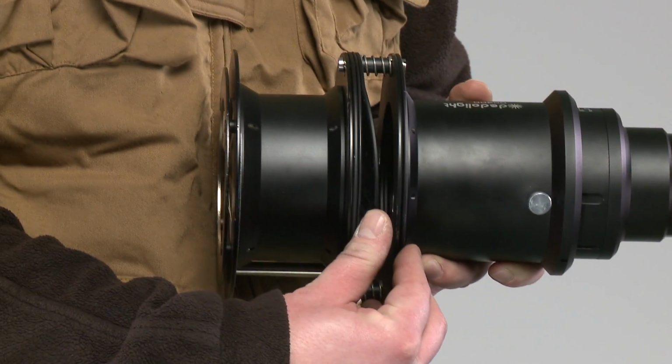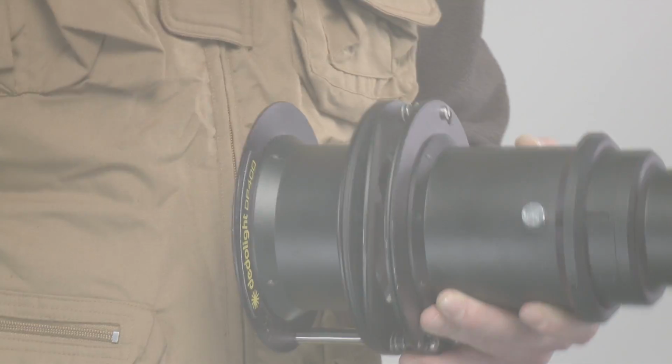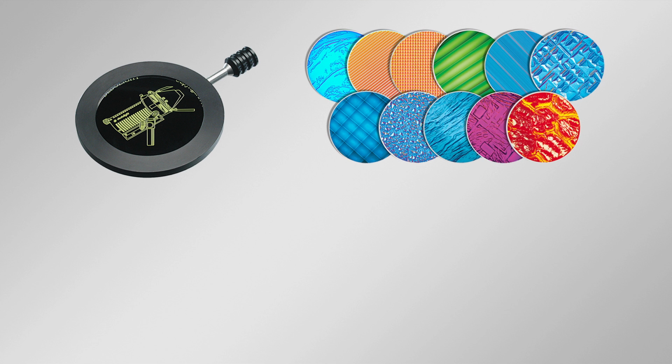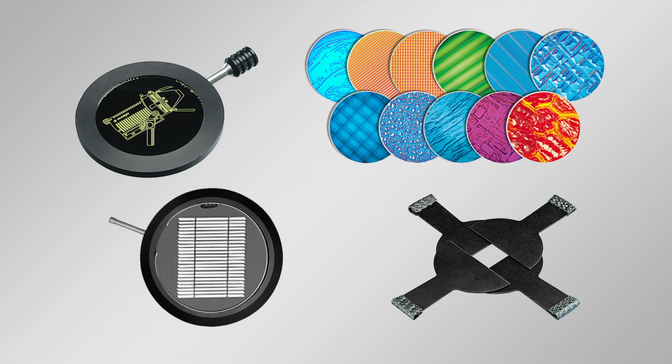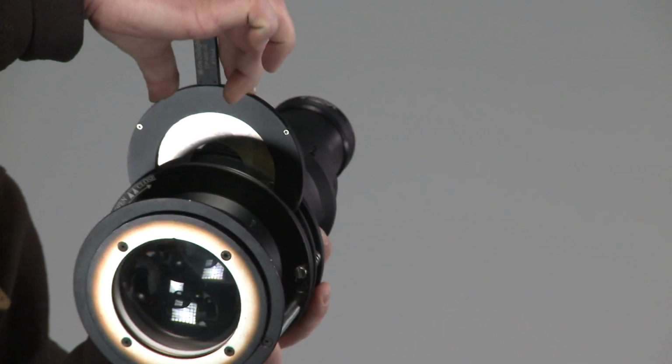Another one is the universal module. This is a receptacle that will accept the following optional accessories: a glass gobo holder, a holder for special background effect glasses, a steel gobo holder, a set of loose shutter leaves, which are not always easy to operate as they are with a dedicated framing shutter device, because here the shutter leaves may touch each other, which takes a little extra time and care. This module also accepts the 18-leaf iris for round projections.